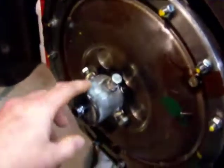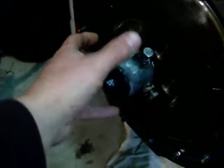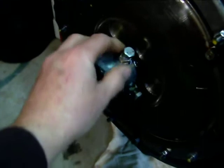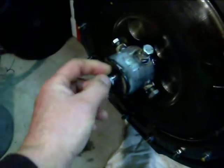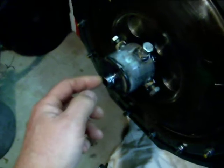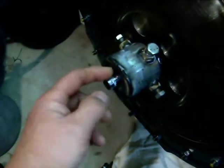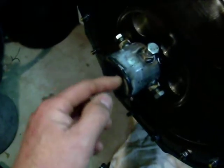This adapter is basically a piece of pipe. I welded some nuts through it and some screws. You can use those four screws to center this on the shaft. I welded a large washer to this and sacrificed a cheap socket — a 3/8 drive socket — centered that and welded it.